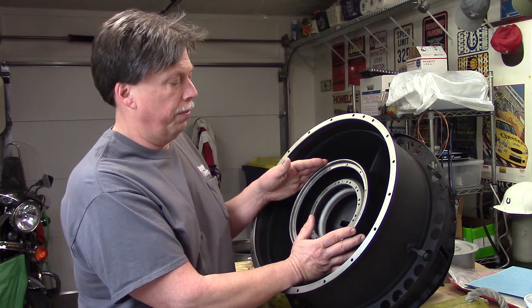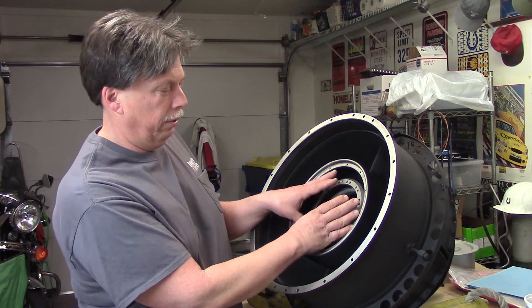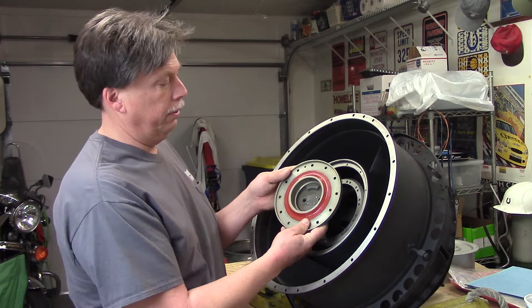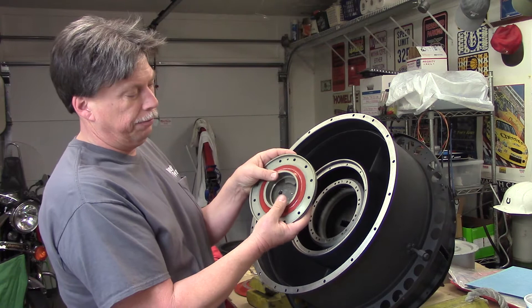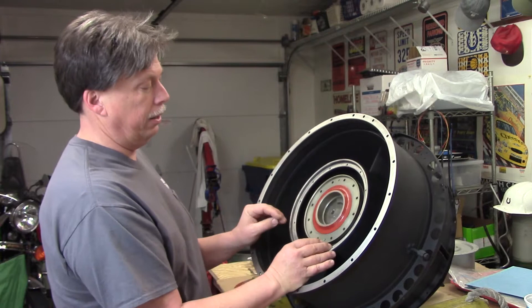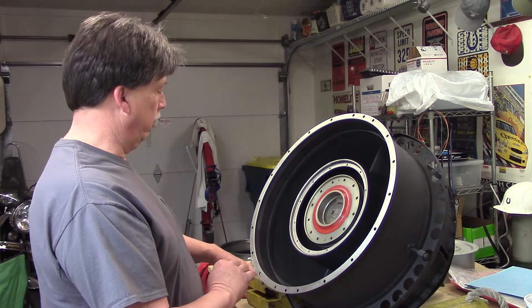This assembly will hold the turbine bearing and also has chambers and passages for cooling air circulation to keep the bearing cool. This piece here is the turbine bearing housing itself. The actual bearing outer race presses or fits snugly into this area here. This assembly actually installs like that and fits back in there, so you can already see where the bearing would sit.